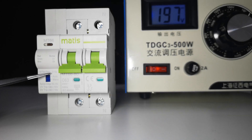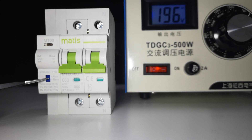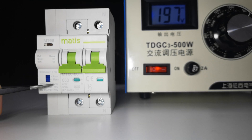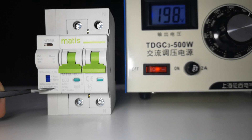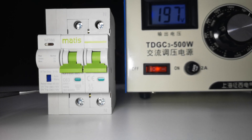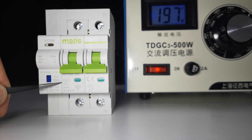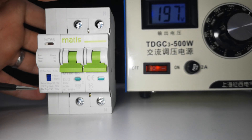There is an auto and manual mode. When you receive the device it is in the manual position. The reclose voltage is 185 volts plus or minus 10 volts. The undervoltage trip is from 160 volts plus or minus 10 volts. The overvoltage trip is from 290 volts plus or minus 10 volts. This is a C63 amp model.